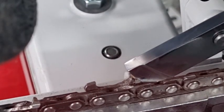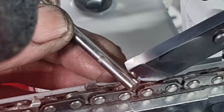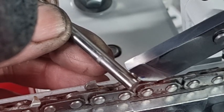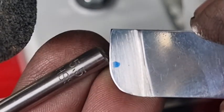We're getting over a millimeter clearance. This drill shank is 7/32 or 5.5 millimeters, and you can see the clearance here — it's just over a millimeter. That's fantastic because you just take this tooth and the other thing that's interesting: where I've got the blue dot, that's where it touches the top of the tooth. The top of the tooth rests where that blue dot is, which is up a lot higher. That was Type 1.